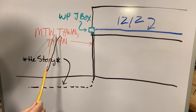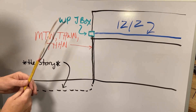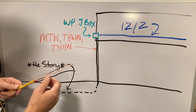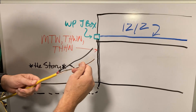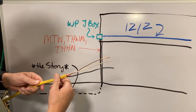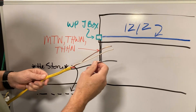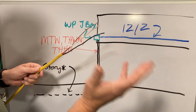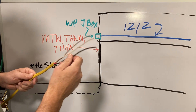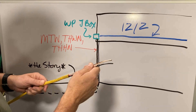If you see the letters MTW, THWN, or THHN — that's usually the stamp you'll see on a roll of individual wires. We all refer to them as THHN. The wires inside Romex have no such markings — they're not marked at all. South Wire says these are rated for 90 degrees Celsius, which is fantastic, but they're not rated for any particular location. You have to assume these wires must stay in a dry location.